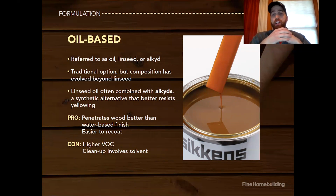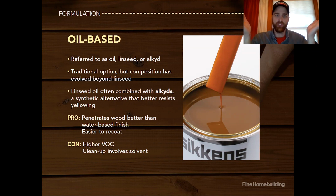In the real world, you're likely to see mention of alkyd, acrylic, or other chemical keywords. Sometimes you don't even get that clue. You just get generic wording like waterproofing wood finish or deck and siding stains. Or like I mentioned before, wood protector toner waterproofing sealant. Still my personal favorite. But knowing some of these indicator words will help you sort through the options. So I'll also give you those clues to have in shopping.